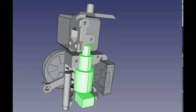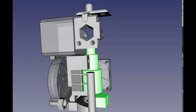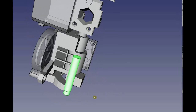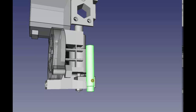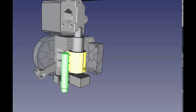Because these parts are getting 3D printed, there's not a compelling reason to make them simpler if this really works well already, right? The only thing I would change, if anything, is that we did discuss not using the 4mm probe, but an 8mm probe, because of how close you have to get. With the aluminum bed and the PEI surface being so thick, it's very close to the prints that you're making.